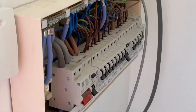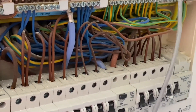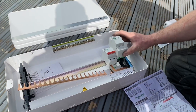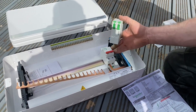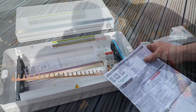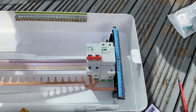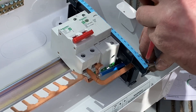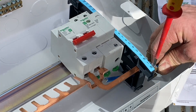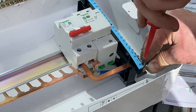As we look inside the consumer unit you can see there's a lot of circuits, but it's not the neatest. We expect Ross to return it in a much better state. The first job with the EZ9 board is to configure it for surge protection, so we need to make a few changes — the main one being the neutral connection to the bus bar, which means rerouting it. That did flummox us a little at first, especially the live bus bar, which has to route itself underneath the neutral. But it's a relatively easy process once you read the instructions — always a key thing.